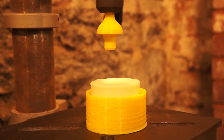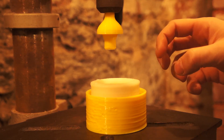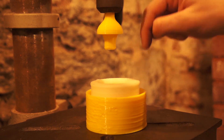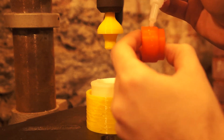I don't want to rely just on friction to make sure the hubs stay in the wheel. I went back and forth between what type of adhesive would be best. I was considering super glue and an epoxy. Epoxy would get in between all the layer lines and lock things in place, but it doesn't offer much rotational stability — it would really stop the hub from moving laterally, but I don't know that it would stop rotational movement. Whereas super glue is more of an adhesive, so it might stop rotational force, but it's a little more brittle and might not stop lateral force as much. I'm going to run with super glue on this experiment.